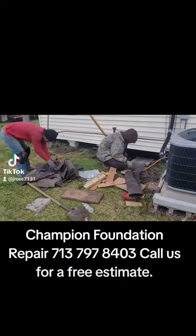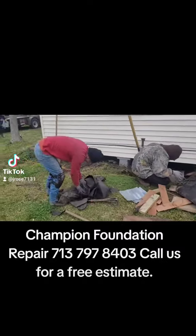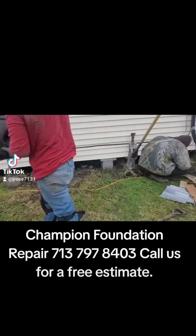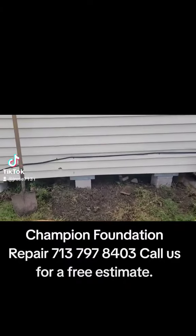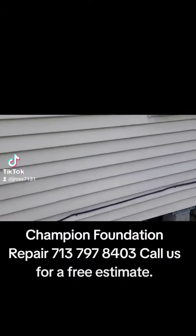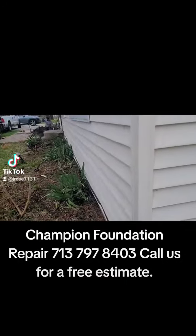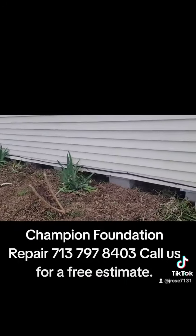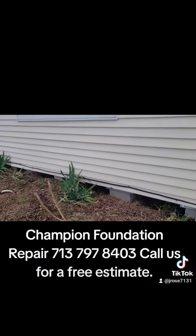When it comes to your good stacks of blocks, we straighten them out and add additional stacks of blocks as needed to help stabilize your foundation. We wrap all your blocks in shiny termite protection shields — keeps the termites from crawling up and eating your wood. When it comes to the wood underneath, your perimeter beams, your floor joists, any wood that we have to replace or add on is chemically treated green lumber, which keeps the termites and moisture from getting to it.